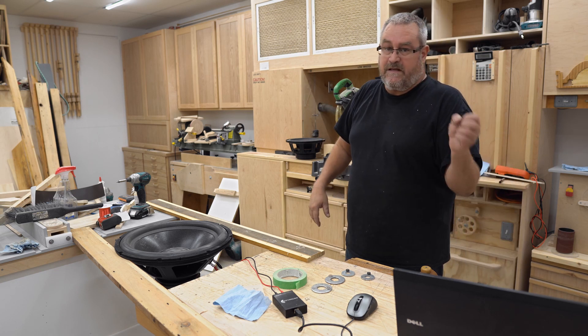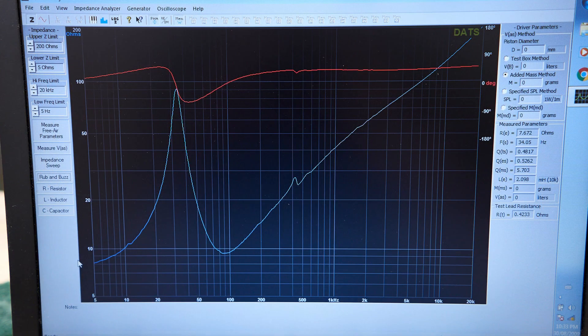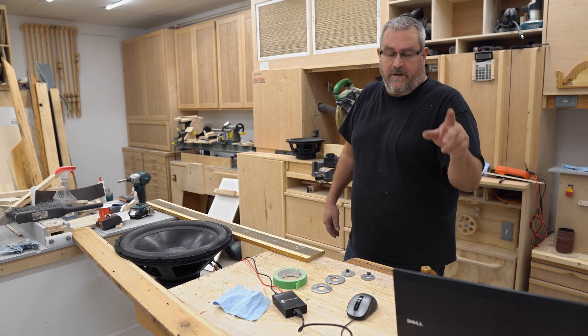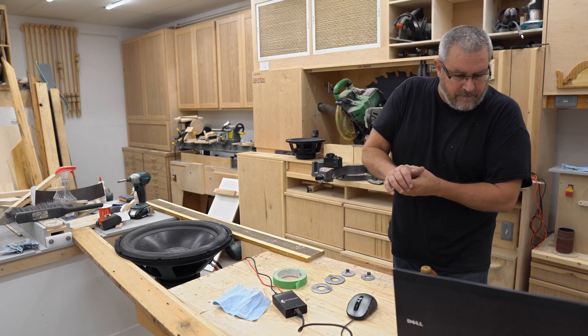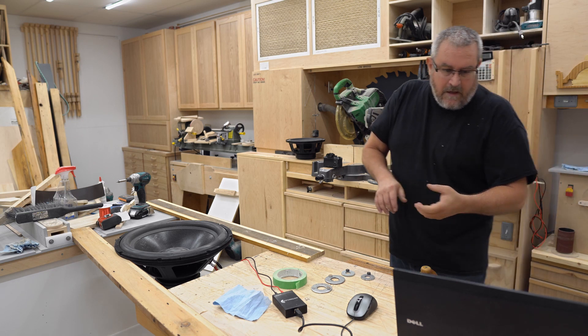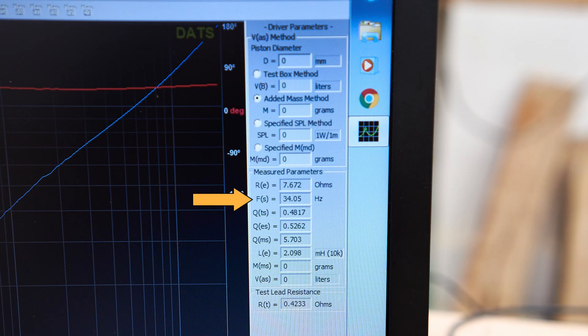It made that chirp, and now it's giving me the impedance sweep. That's a sweep that goes from zero right up to 20k, and it shows the impedance — that's the blue line. That red line above, you can ignore — that's phase, which is a little more complex. But as you can see, it's exactly as I described: it goes up in a peak, and looking at the peak it looks like it's somewhere around 33 Hz maybe. But I don't have to guess because that figure is over on the side — I'll get a picture of that and we'll go in close and have a look.